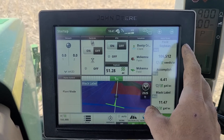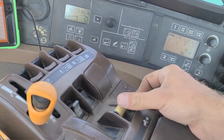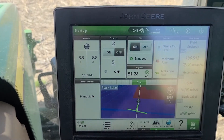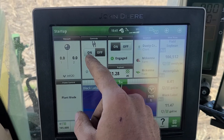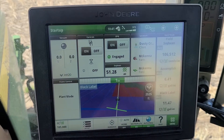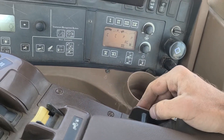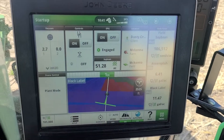Going back to the start page: first we will turn on our PTO to run power, then we can click the EPG on. Next we're going to click on the pump for the exact rate pump, turn that on, and then we'll turn on the vacuums. We have those on SCVs three and four — click those into the on position, three and four.